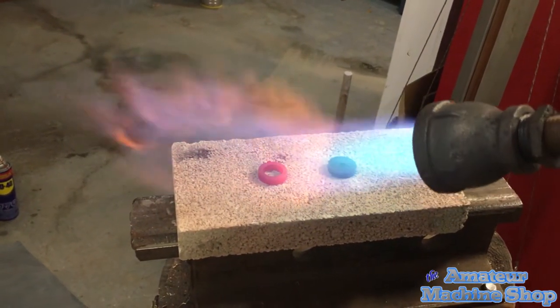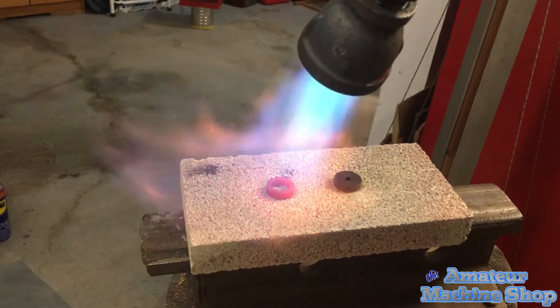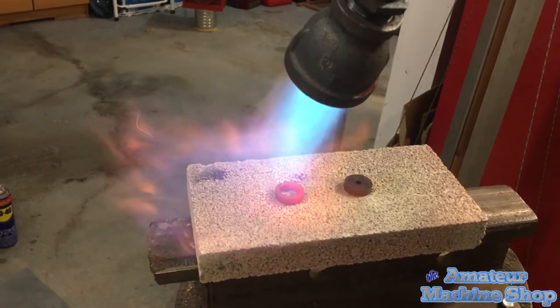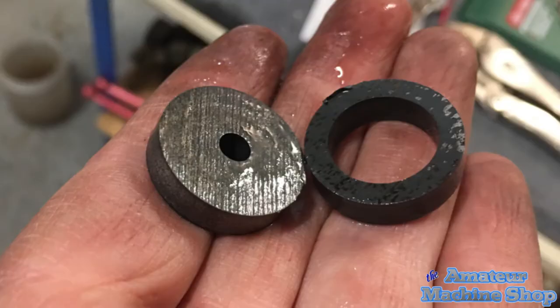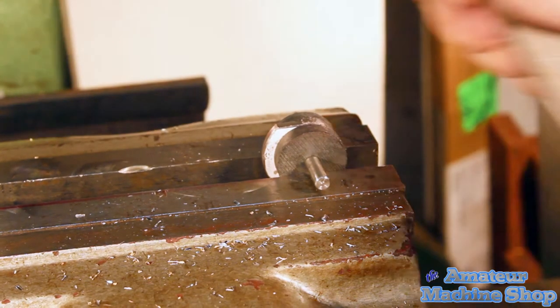I made two small rings, both 23mm outside diameter. For one, the bore was made to 19mm and the other 5mm. This allowed the cam disc to be sandwiched in the middle. Now when the file is placed on the material, it is easier to file the profile.